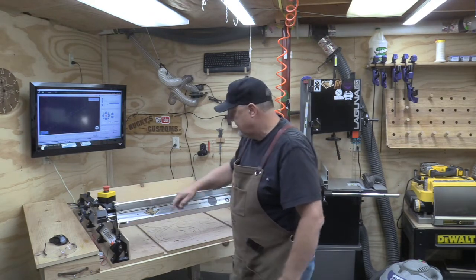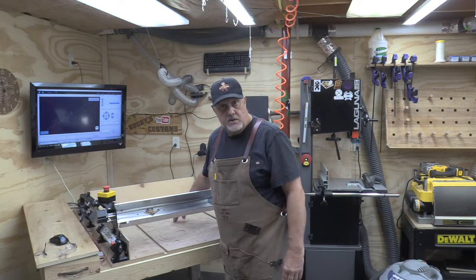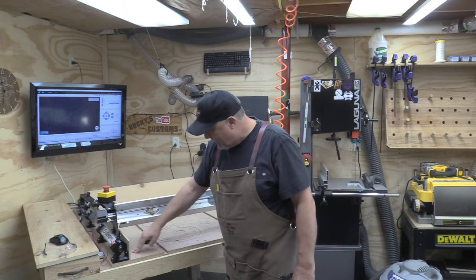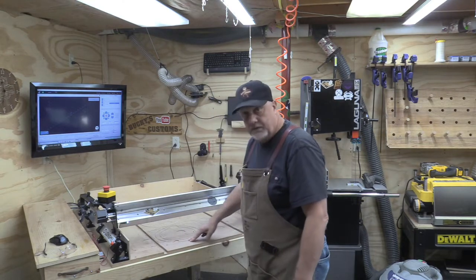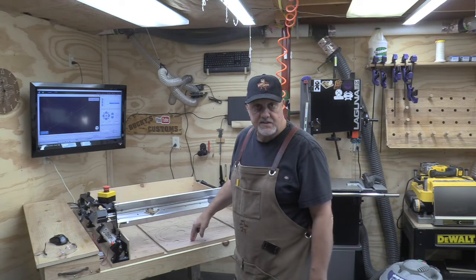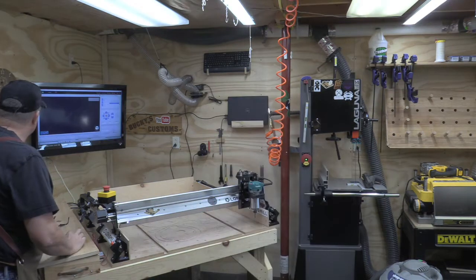What I'm cutting is a 30 by 30. I'm going to zero off the center, and I'm also going to come out here where the taller part of the wasteboard is and do my Z-axis 0. So we're going to load this file. Y'all have done this before.